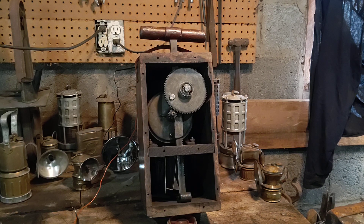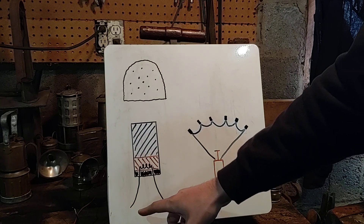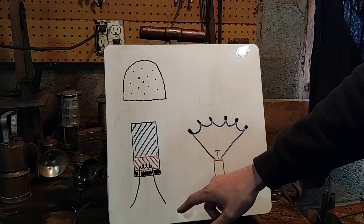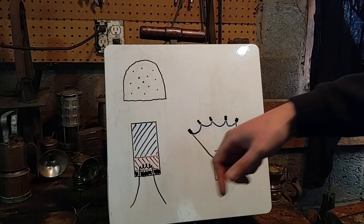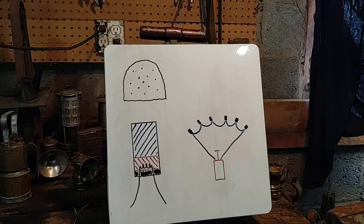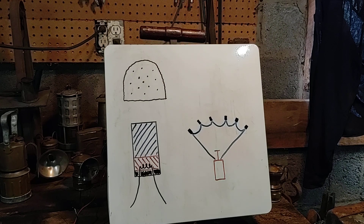In the 1880s they came up with a high resistance wire style blasting cap, which is still the kind used today. We covered electric blasting caps in our introduction to underground blasting videos. We have one leg wire coming in, a bridge wire, and another leg wire heading out. When electricity is sent through it heats up the bridge wire, which sets off the explosive charge. In the early days the charge was mercury fulminate; now there's a myriad of explosives used. This was contained inside a metal shell and plugged at the back with sulfur, which has a very low melting point and was compatible with the explosives used. The wires were coated with cotton fiber and soaked in asphalt; for mining they were soaked in paraffin wax, making them lighter in color and easier to see.